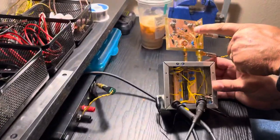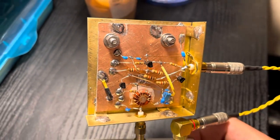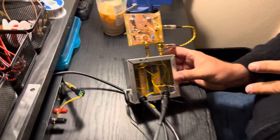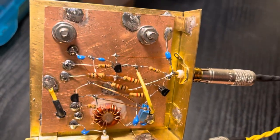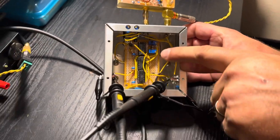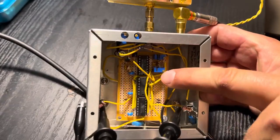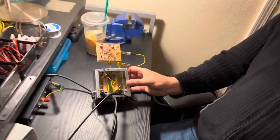When I built this, it has a crystal oscillator with a buffer, but the output was too low to drive the board. So I added another buffer stage to increase the output — I put a second buffer stage on there and the output did get larger, but it still wasn't enough to drive the board. The problem arises on the JK flip-flop clock input: I have a 100 ohm resistor going to ground, and that tends to drag down the signal, so it just wasn't enough to drive it.